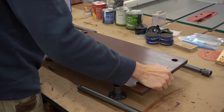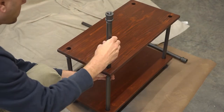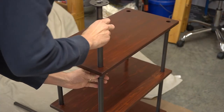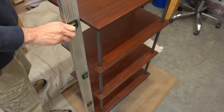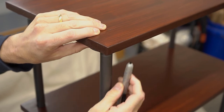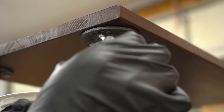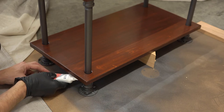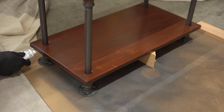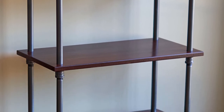And finally, it was time for the assembly. I started by disassembling the legs, being careful to keep track of which pieces went together. I then worked from the bottom up, attaching the pipe to the couplings through each shelf to avoid scuffing the paint on the pipes. Next, I set the top in place and used a long straight edge to line it up with the shelves below. Once I was happy with its location, I marked the location of the holes in the flanges and carefully drilled pilot holes in the top. To attach the legs to the top, I used 3/4-inch flathead screws and touched them up with two coats of paint. The shelves were already quite stable, but I decided to run a bead of clear silicone caulk around the top of each coupling and press the shelves down into it. Once the caulk dried, it removed all the movement from the shelves as the caulk filled in any of the gaps in the holes. Just be sure whenever moving the shelves, you always hold them by the legs. Before moving them into their new home, I cut a few pieces of drawer liner to sit them on in order to protect the flooring.